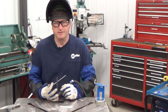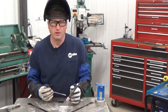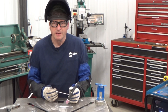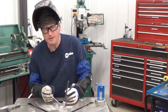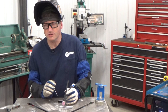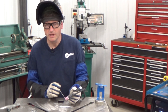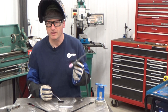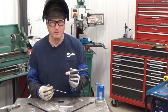Two more things to practice. One is post-flow gas coming out of your TIG torch after you feather off the foot pedal at the end of your weld. Keep your TIG torch at the end of the puddle because it has to shield that molten puddle while it's cooling, and it also shields the tungsten while it's cooling. If your tungsten is turning blue or purple, it's probably because you pulled the TIG torch away before the tungsten was adequately cooled.